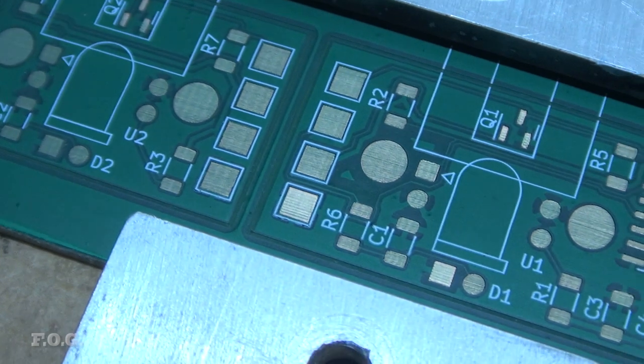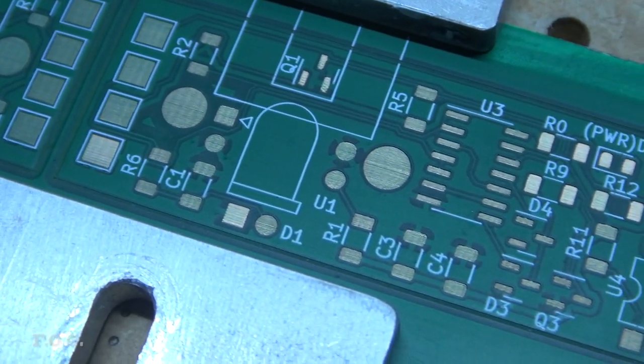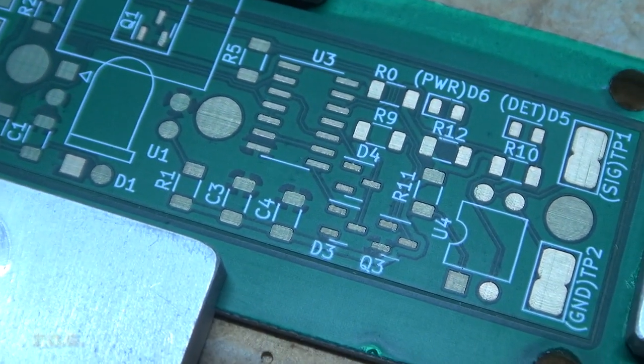At first, with the naked eye, it looked pretty much as I had expected, seemingly only requiring a second pass. But under the microscope, I could see heaps of tiny resin lines. But these were only on pads cleared with the vertical path. Horizontally cleared pads seemed fine. Now, the reason for this is something that I'd already sort of noticed, but not given much thought to. The shape of the beam is, in fact, not a circle, but elliptical, being a little bit wider than it is tall.